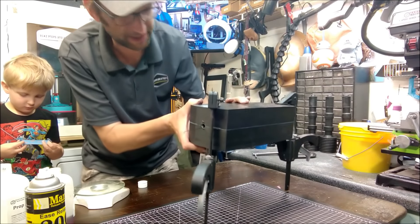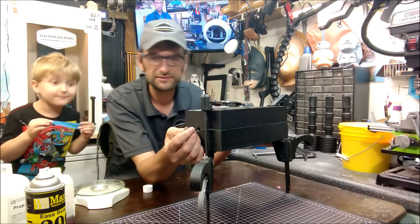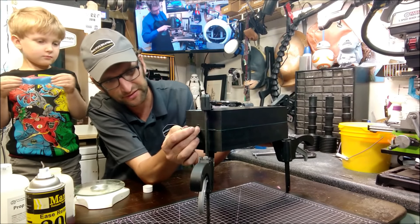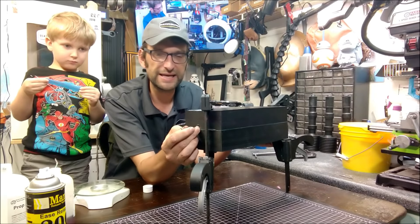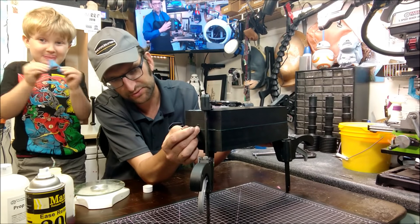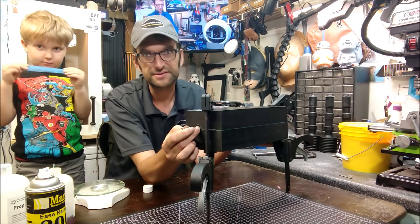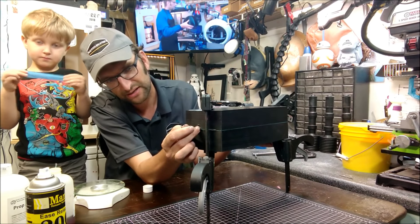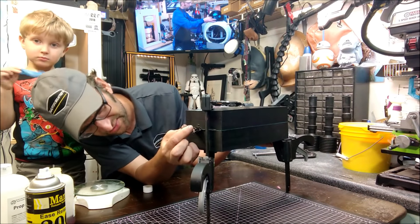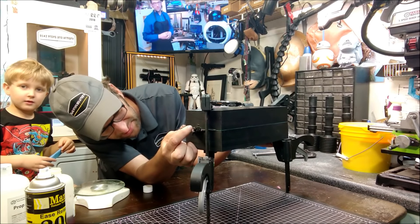What we're going to do is go ahead and actually turn this over. I'm going to hold my finger over the end so we get a little bit of back pressure in the mold, because we want everything to fill out as nicely as we possibly can. We have to be careful of the back pressure because it's a 3D printed mold — we don't want to let too much stay in there because we can start doing damage to our mold. Too much heat, too much pressure in the mold is obviously going to be a bad thing.